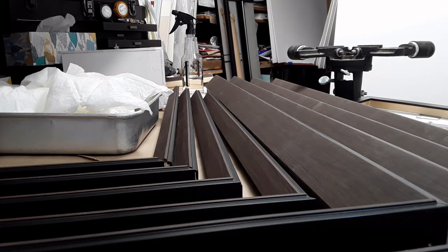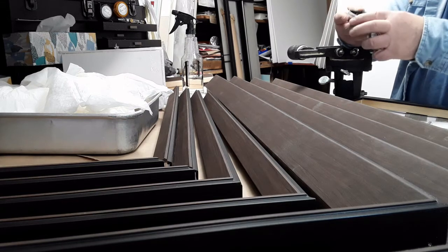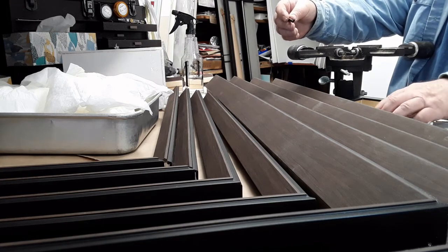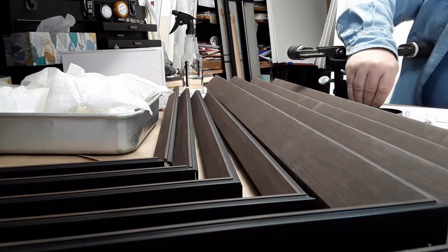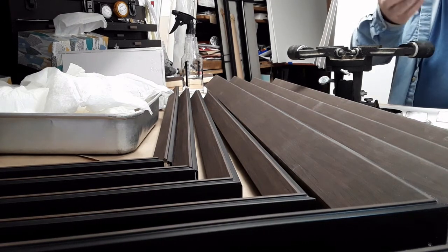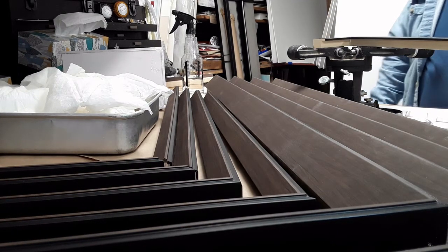After everything is dry, you fill the nail hole with filler. We have a whole bunch of different fillers, but most of what we use is made by AMACO. We keep little pieces of picture frame molding — about an inch or inch and a half long — and just squish the filler into the nail hole, then clean it up with a little tissue. You do that after the frame is all set up and you don't want to handle it until then, but then you can hardly see where the nail hole was.